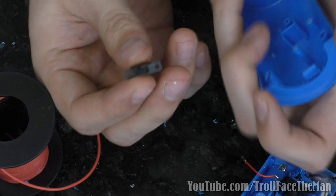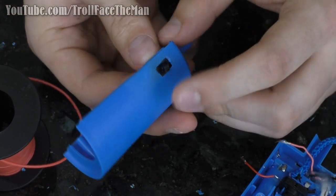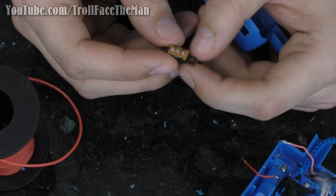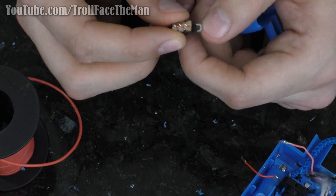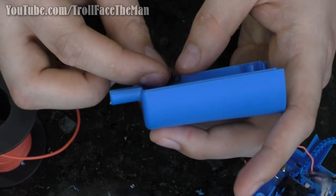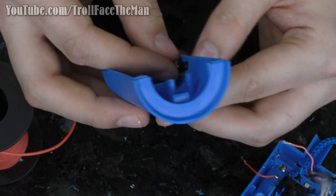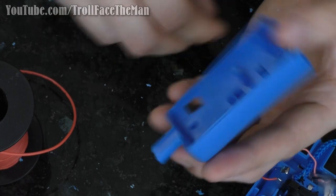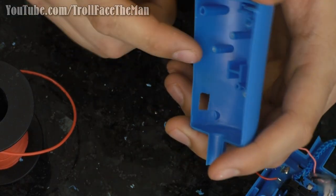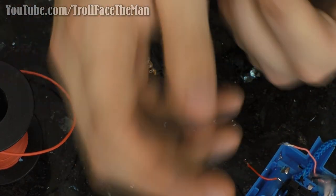Considering this does have screw holes, I could potentially fasten screws from the outside in. But typically you use this type of thing with machine screws and then nuts on the end of them, which I don't have any of those. I could always just try and simply hot glue it, but I don't think that would hold up to the pressure very well. So what I was thinking is I do have some 1 minute epoxy. I could put a couple of little dabs on there and then just hold it for 1 minute. And I think that might be the strongest option.